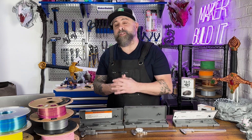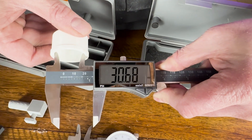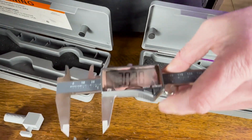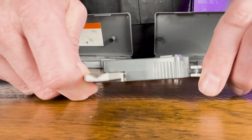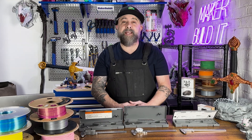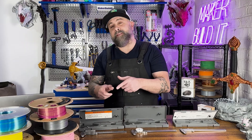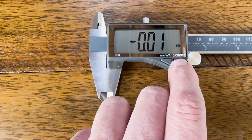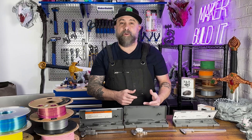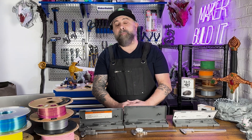So how are calipers used in 3D printing and 3D modeling? Digital calipers are ideal for 3D printing, where rapid and accurate measurements can speed up calibration and part verification. They're also great for 3D modeling, especially if you're building something to scale or reverse engineering a replacement part. Regular calibration is crucial for accurate measurements. Most digital calipers come with a zeroing function that lets you calibrate back to zero easily, while dial and vernier calipers require manual adjustment.